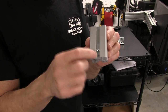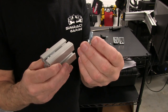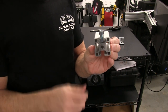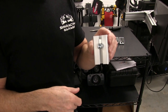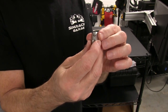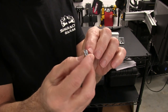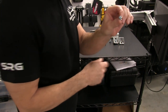We'll predominantly be using this 8mm T-nut and the 8mm cap bolt. There are a couple of different lengths for different situations — a thinner one would be used when attaching something with a thinner flange sitting on top of the profile. We also have these, which are the same spring ball T-nut but with a 6mm thread, for attaching things like your shifter. A few of these are included in the kit along with some 6mm pan head screws — 4mm metric hex wrench size.